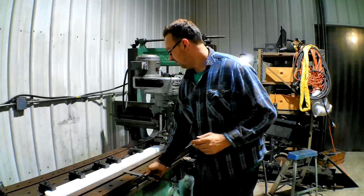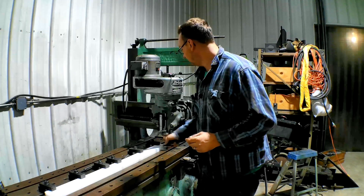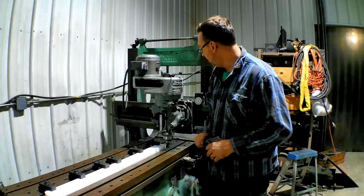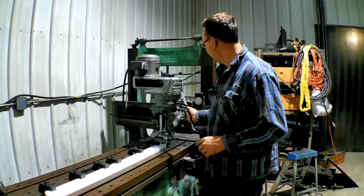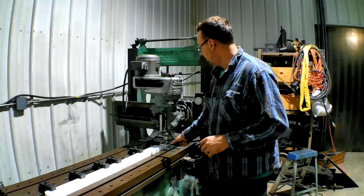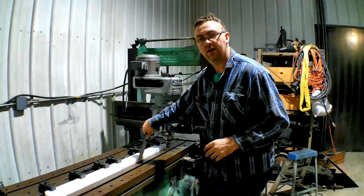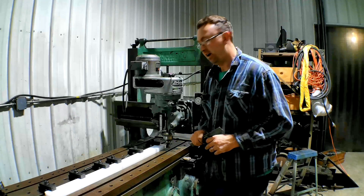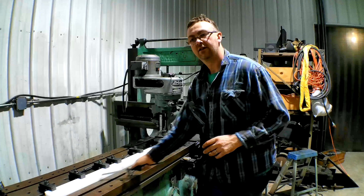Set up was really fast and straightforward. We just used a square right off the side of the table, got everything lined up and clamped down. We have our three insert cutter in the mill head here. We're going to climb mill this, running the Bridgeport head at 2720 RPM — the highest it'll go — going in three quarter of an inch this way and a half inch depth of cut first. Then we'll do a quarter inch depth to finish it off, and then we'll switch over to our Woodruff cutter and cut our inset for our guide.